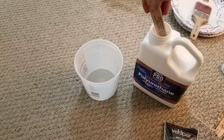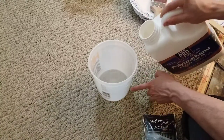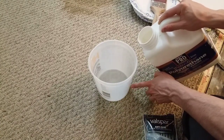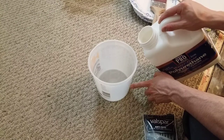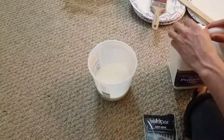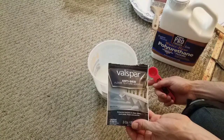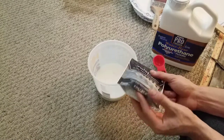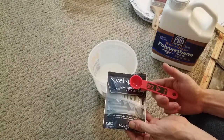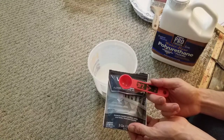Stir your finish or paint, then add it to your bucket. Keep in mind how much you're putting in using the graduations on the side. I want to put in 16 ounces to start off with, just to test how it comes out. Next, measure out the additive and add it to the finish. Since I'm working with one pint, which is such a small amount, it's going to be very hard to measure out an eighth or a sixteenth of this, so I have a measuring spoon. I'm going to start out small, mix it together, and see what it comes out like — starting with one tablespoon, so two of these.